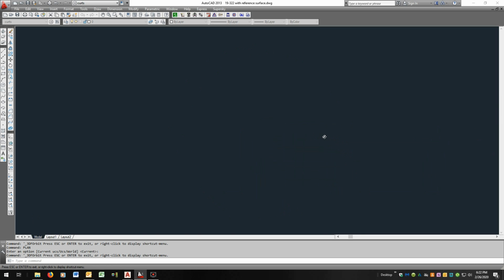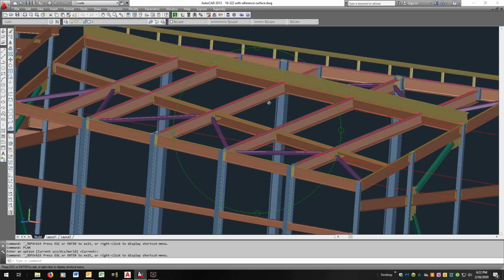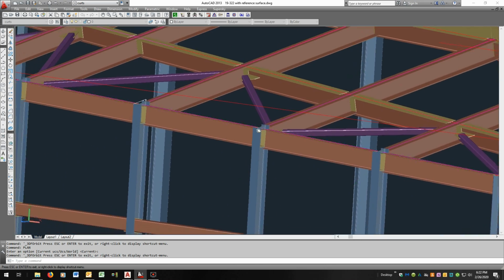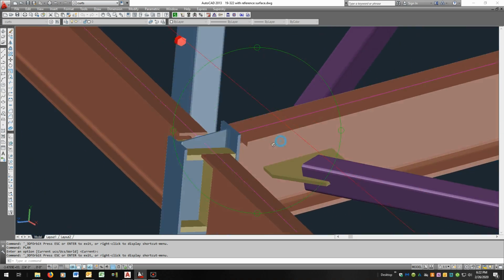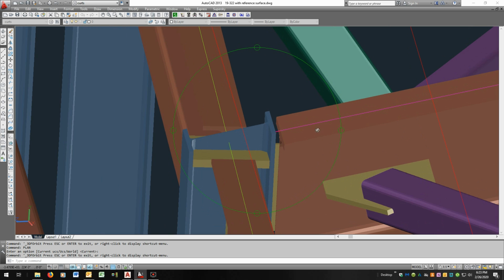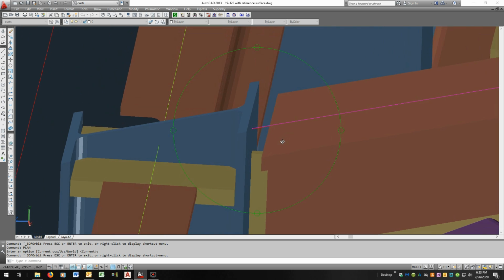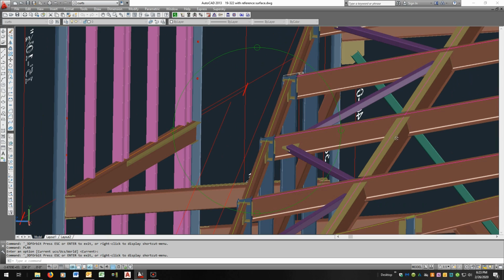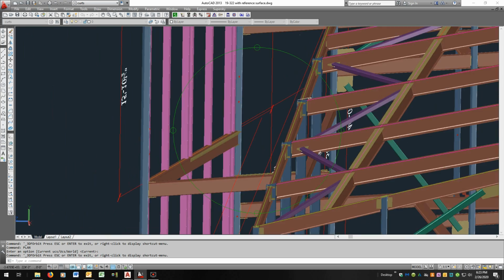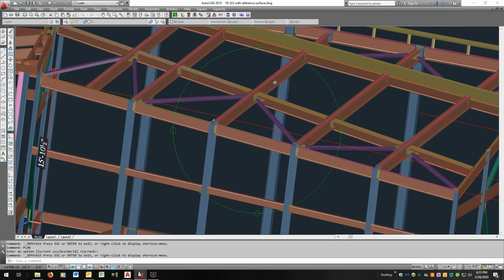It's going to mess up some of the steel connections here. But I think, as we had talked, it gives too much movement in the skylight not to do that. The columns can stay as they are. And I would suggest if you take top center of the I-beam, I kind of added lines in, and then rotate this about that point at top center to be in a plane with the purlins, we should be all right. And then that will all match going up.